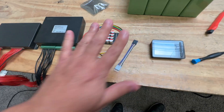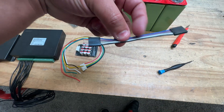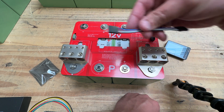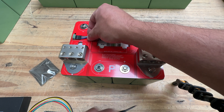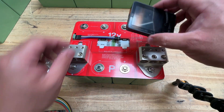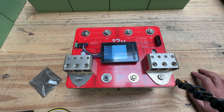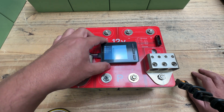We are making these work with that balancer, and these are literally the easiest ones to install because we offer this little cable. This cable is spaced at exactly the same 2.5mm distance as the connector. You put the pin side into the connector — put the black wire on B-minus — and tighten up the screws. Then you grab your Batco balancer, which is labeled with negative right there, put the black cable on the negative lead, and it just turns on. Now you can see the cells: the battery is at 13.31 volts, about nominal — each cell is at 3.3 volts with only a 4-5 millivolt difference between cells.